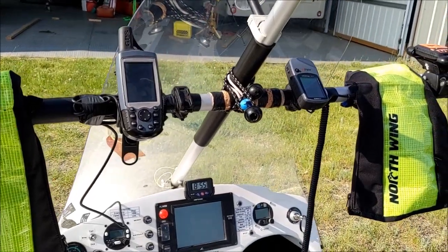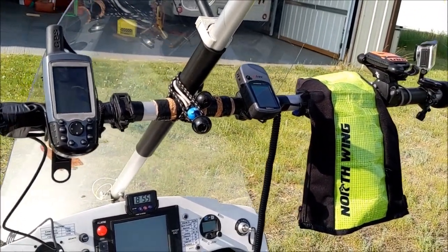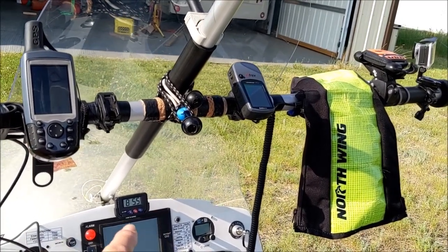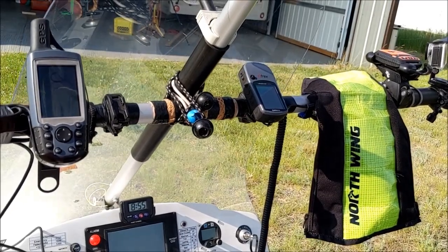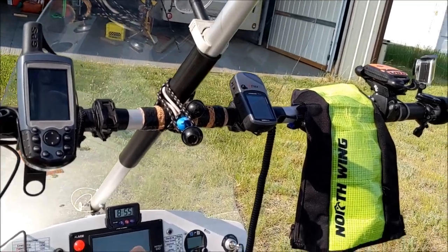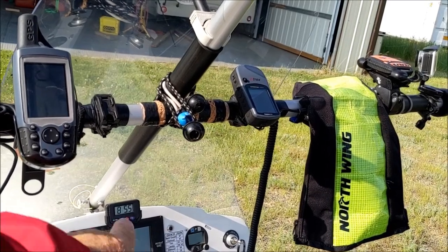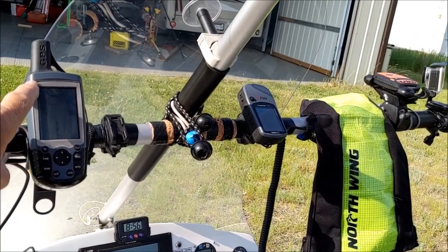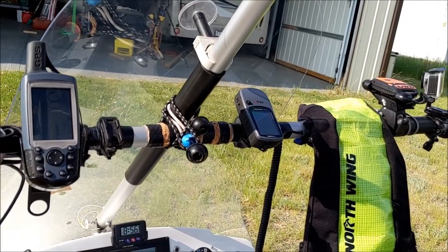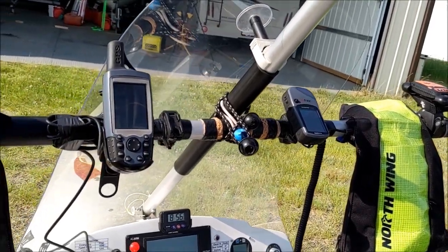So in this case, I get 70 indicated, and the actual speed, I calculated it, works out exactly. Indicated 70, actually it's 60. If this is 60, there is no wind. If it's 70 here, which is actually 60, and I fly and ground speed is 50, which means there is a 10 knots headwind. So I always have to subtract 10 knots from the indicated speed.